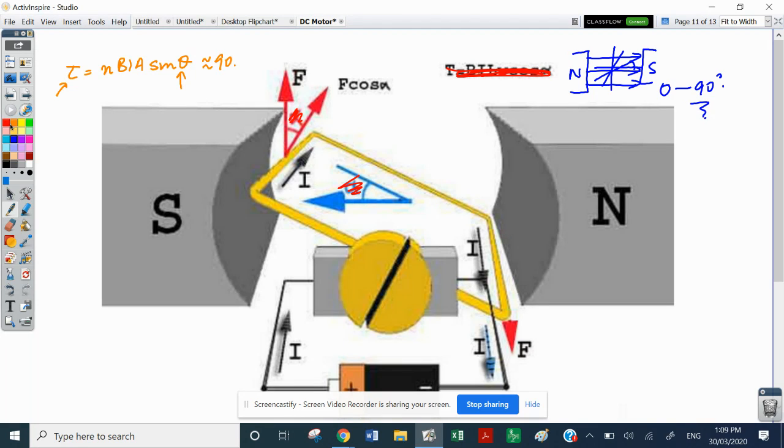So what we do here is, rather than using straight edges, we're going to use a curved surface. If we use a curved surface, the shape of the magnetic field becomes such that it always leaves the surface at 90 degrees, is directed in, and then returns at 90 degrees. So here, it will go from there at 90 degrees from the surface in and out. So we're no longer getting a constant magnetic field, but we are getting a concentration into the center of the coil. And as a result, this makes the angle between the wire of each of these here and here remain at 90 degrees for longer. And as a result, we get a more efficient motion.